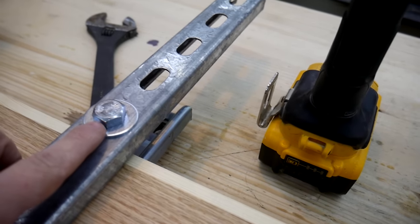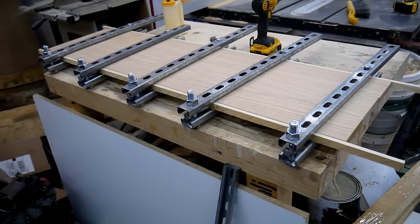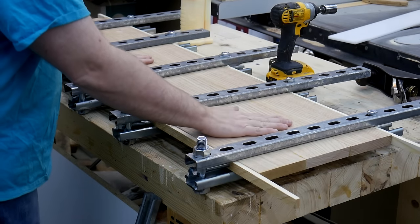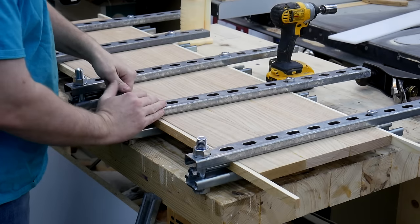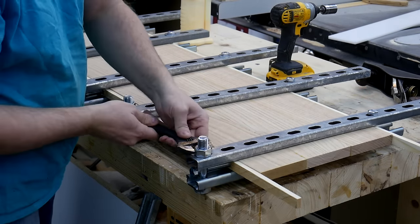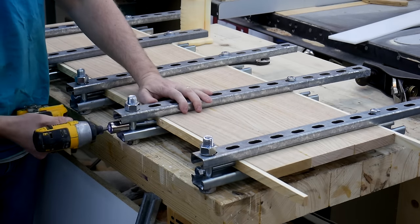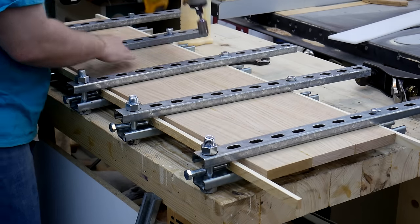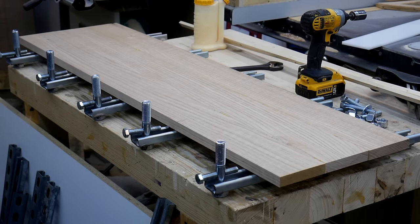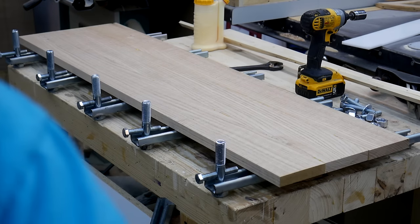With repeated use I do have a couple of washers — that seems to work a lot better. Now I'm going to turn it over and let it sit for a good hour before I take these off, and at that point I'll see how we're doing. I had a good squeeze-out on that side, but not so much on this side — I'm not sure if I put enough glue in there. I'm probably going to have to use hardwood for the scrap pieces because the screws just drove directly into the pine. Sorry everybody — my battery died while I was taking that apart, but I think you got the gist of how easy it was to get it apart. I'm going to take you in close now and we're going to take a look and see how it did.